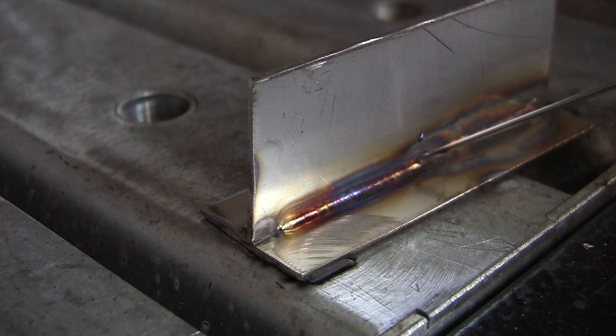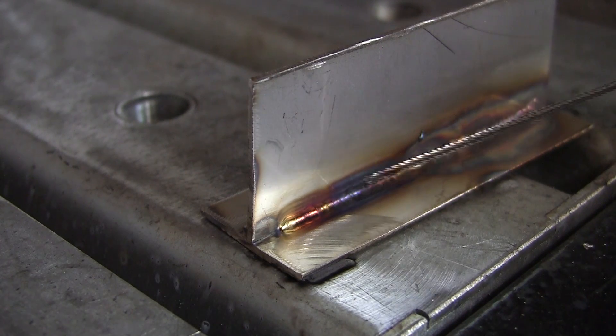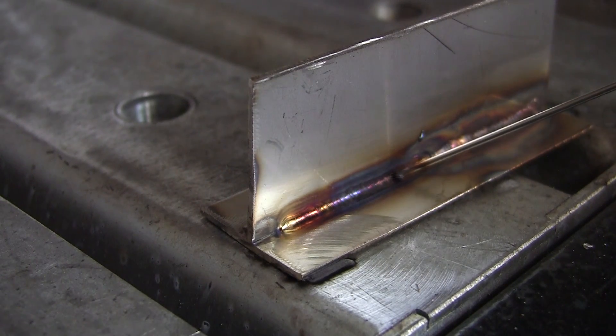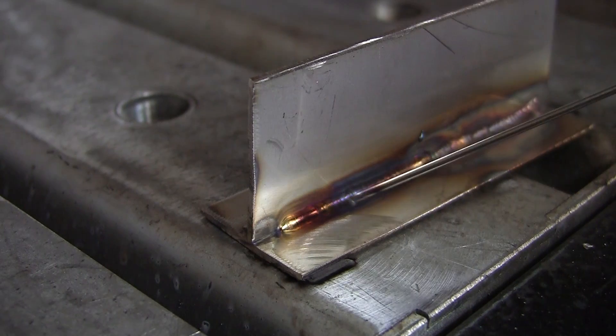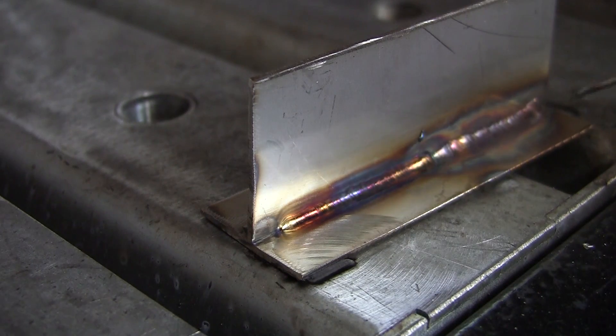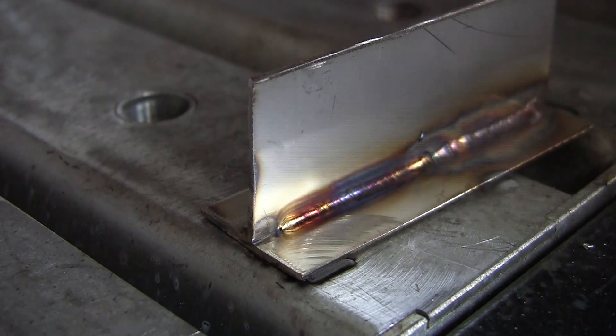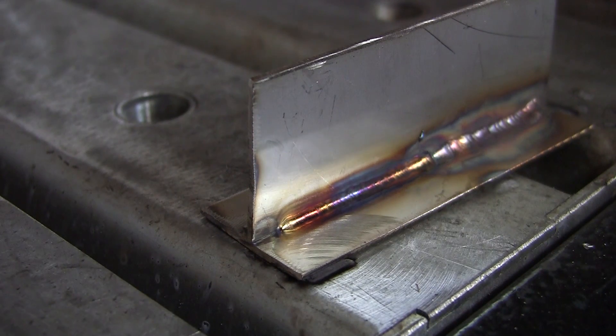And there you go — that's without the rod, that's just fused. Nice and small. You don't have any warpage on the material here. Nice coloration. No burn-through. And that's your rod section and that's your fusion. That's 18 gauge stainless steel with a 308L stainless steel rod.